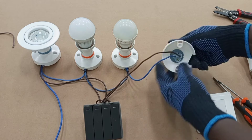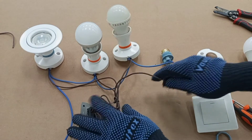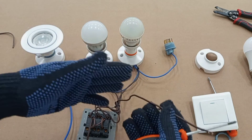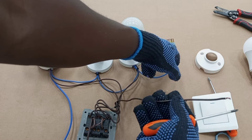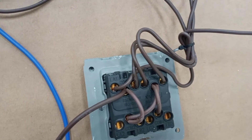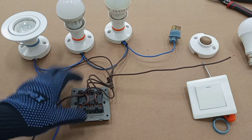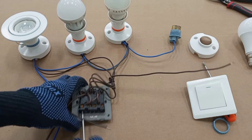I will remove this switch wire from here. Because I want this lamp to be controlled from two different points or locations, the switch wire that was going to this lamp will now serve as a strapper — that's why I was taking it from LE1. I am now going to use LE1 and LE2 as strappers. LE1 is already connected but it went straight to the lamp; now it will serve as a strapper. Then I'll add another strapper from LE2.